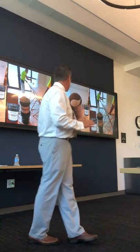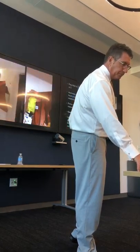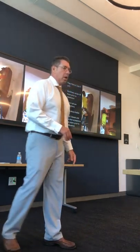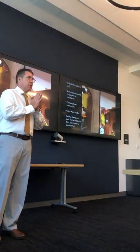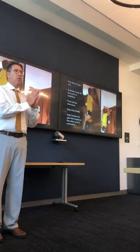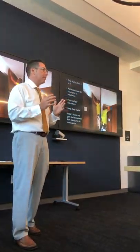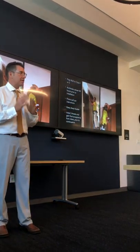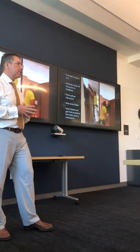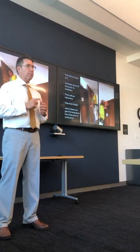The installation starts with a clay-based adhesive primer on the drywall, then you apply adhesive to the back of the sheet. Just like in millwork, your substrate needs to be good. If the substrate is drywall, you want it to be a class 4 or class 5 finish — if you always ask for 5, you might get 4 and it can still work; but if you ask for 4 and sometimes get 3, you may have issues. The AC systems need to be on so humidity isn't too low or too high, and the product should acclimate.